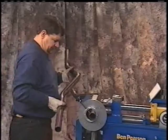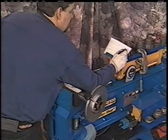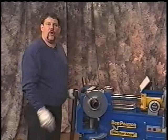Again, you'd go on the back side, you'd go over the top, whatever works the best for you. Okay? Now we'll record that amount of depth of the bend here. It looks like it's 28 degrees. So we got 28 degrees. You'll then mark your rear for cut for the proper length that you desire. Measure from that bend to the end, which will add to your length here, which will give you a total length, and you can mark that as your cut.